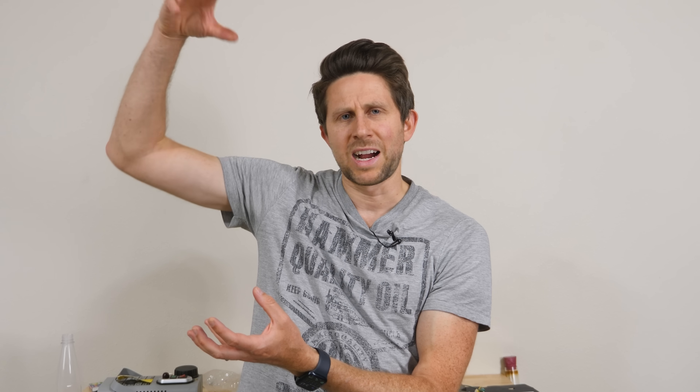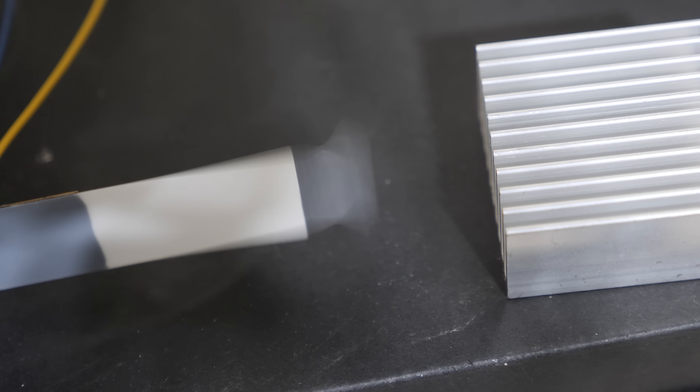Now you can see that we can get some really good airflow going here, but it's not quite the airflow that you'd get with a high-powered fan. But in applications where you don't need a ton of airflow but just a little bit more than natural convection, these piezoelectric fans work really well. For example, in space modules where people are living, electrical components heat up easily — normally hot air rises and gets out of the way through natural convection, but in space there's no buoyancy so that hot air just stays in place, and you need some forced convection to move it. Another neat application is that with a regular fan, you turn on the power and it has to spin up to speed first. But for this device, the power up is instantaneous — it starts vibrating at exactly the time you apply the voltage. So you can get really precise temperature control where you need to turn it off and on really fast without waiting for a rotor to speed up.